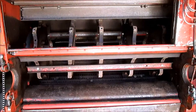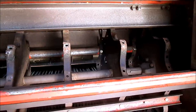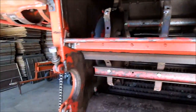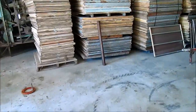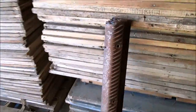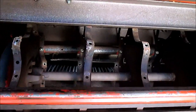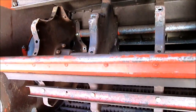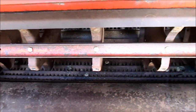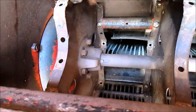Okay, ran into a bit of a problem while me and Charlie were going to look at and buy that 550. My friend, I had him taking off our rasp bars, and I didn't tell him that I just wanted the rasp bars taken off. So by the time I got back after a couple of hours, he had everything off of the spiders, which wasn't a big deal. Probably lucky that 2 of the bolts he was not able to get loose, so I didn't lose my correct sequence, if you will.